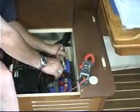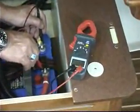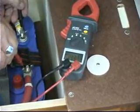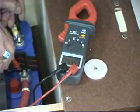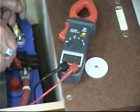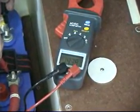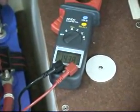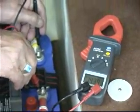We now have the engine running, we are going to rev it up a little to excite it, and we see we are getting a reading of 14.34 volts, which is well within our parameter. Now I know this battery is almost fully charged, so it is not going to give us that much of an increase. The voltage regulator is telling it not to put out more, and we are settling in at about 14.39 — we will call it 14.4.